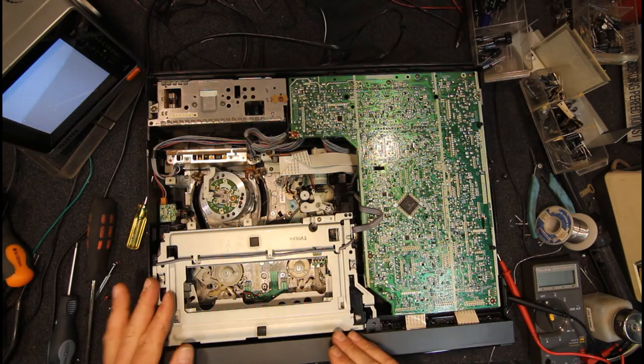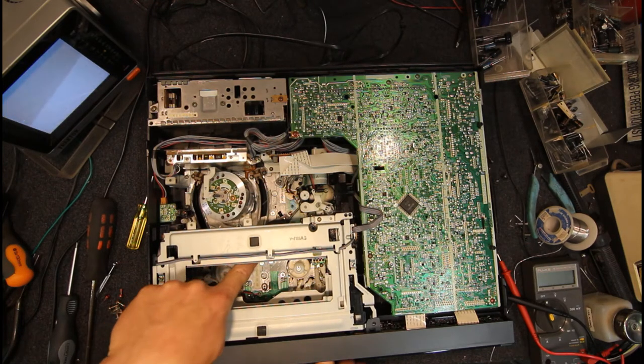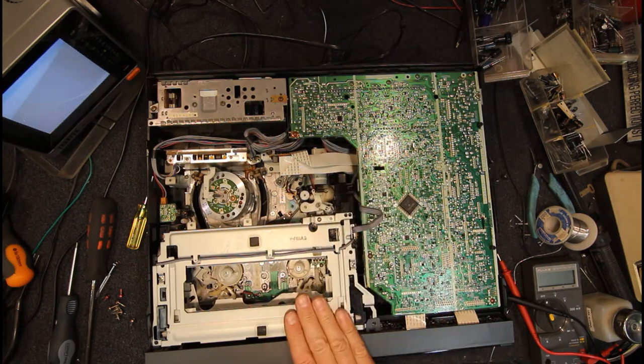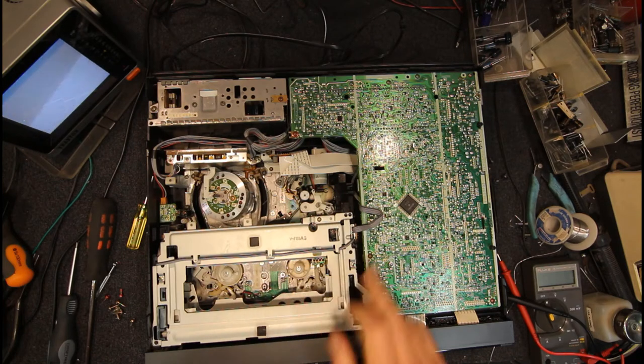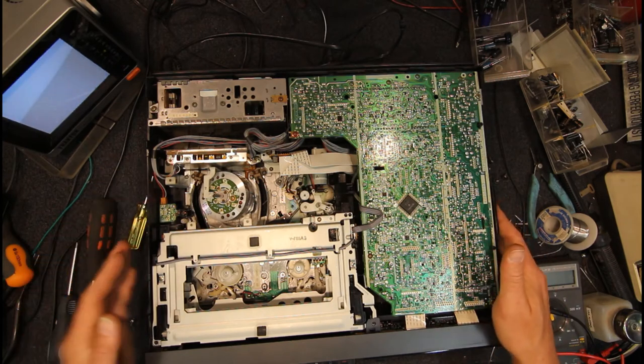And what happens is when we've got the lid off like this, sometimes one of those will get triggered or something. Because often they use them as well for when you push the mechanism in, this infrared little LED will be on, and it's not that end, but I think the other end, can't really see where the hole is. But often a lot of these machines, rather than have a little switch here or something to detect the tapes in, as soon as this mechanism starts pushing in, it actually blocks one of the photodiodes off. Obviously the mode switch and stuff knows the machine's ejected. So if one of those photodiodes gets blocked, or it could be that it gets light, it depends, sometimes they block them. So having external light into the machine because of the lid being off, it can set off one of those photodiodes and it'll start trying to load a tape in automatically because it thinks you've actually pushed the mechanism in. So that could be why that takes off occasionally.